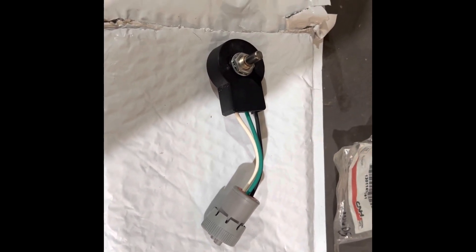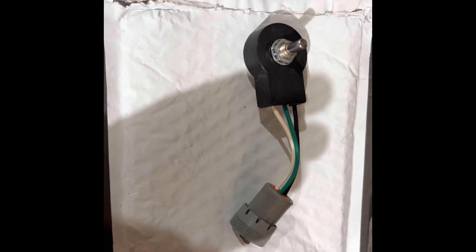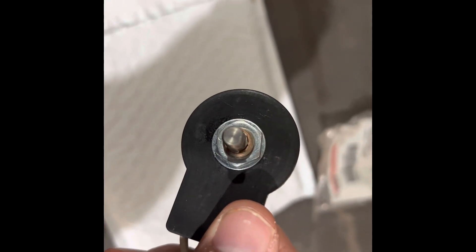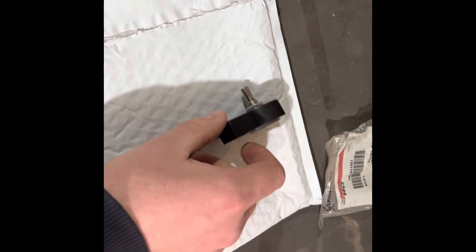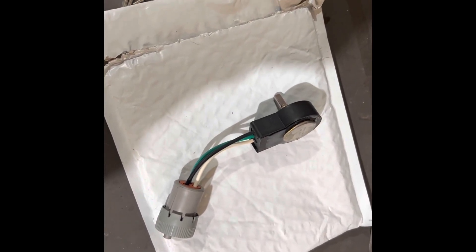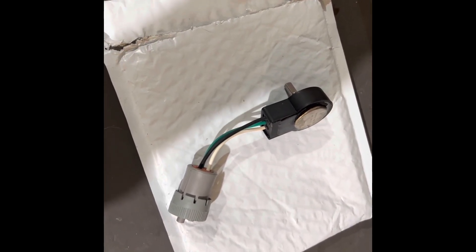On the header there's some linkage, and this is basically a potentiometer. This potentiometer mounts on the side — I'll show you in a minute what it looks like on the header. The pot will turn; it's got a flat spot, and there's a little set screw that goes on that. As that linkage moves — it's basically like a reaction linkage — it senses the height of the header in relation to the ground. The pot is sensing that and sending a signal to the combine, and then the combine has a module that will control your header height when that's engaged.